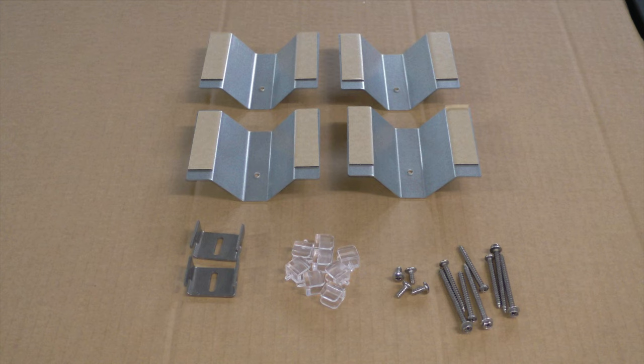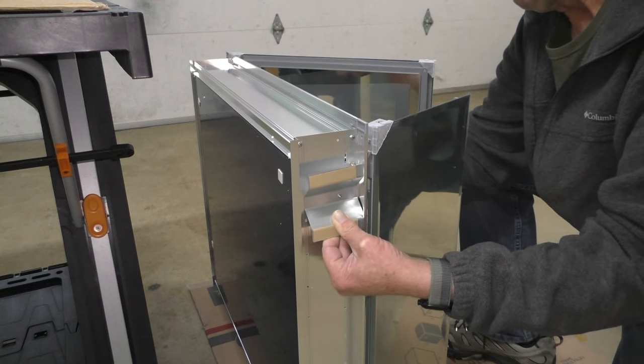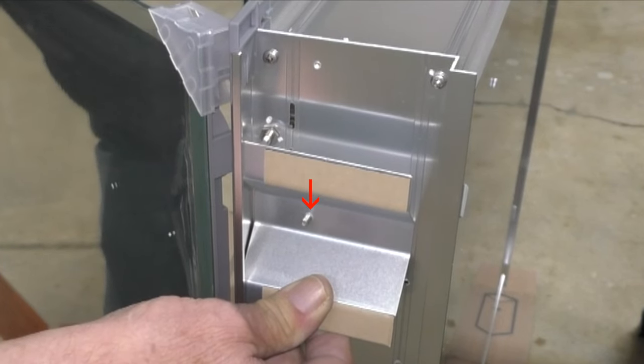I have limited area in the bathroom to install the cabinet, so I'm going to skip to step 11 in the instructions and install side brackets and the side mirrors before I place the cabinet on the mounting bar. Each side bracket takes one of these shorter screws, so while holding a bracket in place I'll thread one of the screws from the inside of the cabinet clockwise into the bracket. I need to repeat this step for the other three side brackets.